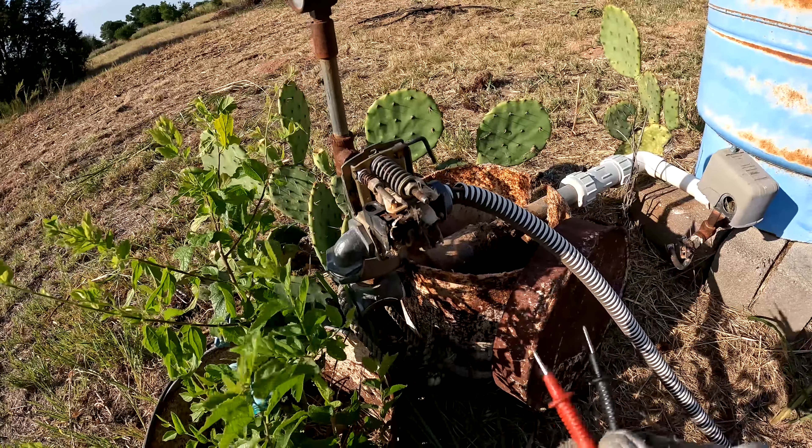I opened it up even more — it's going up. I can't run it too long because the pump isn't supposed to run continuously like this, but it was a way to test the well and see if we had water — which we do. I can actually feel the pump running down there. I'm going to go ahead and turn it off now. The box smoked when I hit the breaker, but I think it was just because it's dirty in there. Power's off — it'll take a minute to depressurize. Day well spent — we have a well!